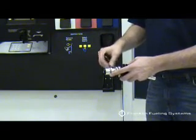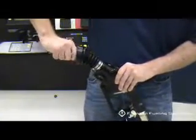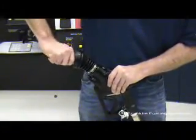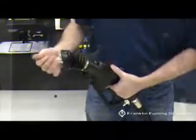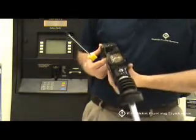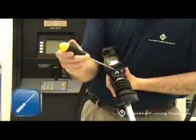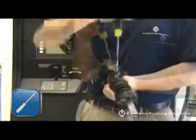Carefully insert the spout into the nozzle, lightly pushing together until the spout aligns itself and resistance is felt. Install the new number 8 pan head spout screw and o-ring provided with Healy part number 8155 replacement spout, and tighten securely to 12 inch pounds.